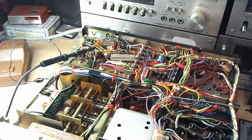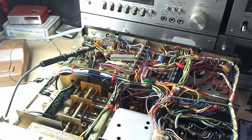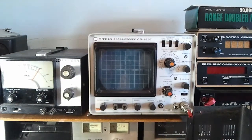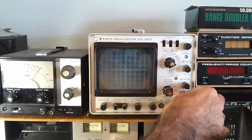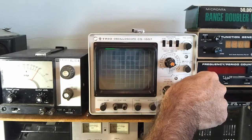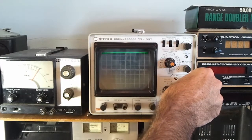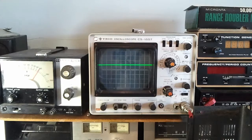The scope probe is now connected to one side of the parasitic stoppers on the 6146s on the input side, so that should show us the bias voltage and also the input signal. We're looking at the DC, and we're looking presently at the bias on the grids. So if I put the scope so that zero volts is right up at the top graticule there, and we're on two volts per division at times ten probe — so that's twenty volts per division — we've got approximately minus ninety volts bias, and that's in standby. So if we go to transmit, we go back to three divisions, which is sixty volts bias.